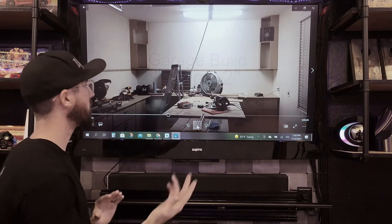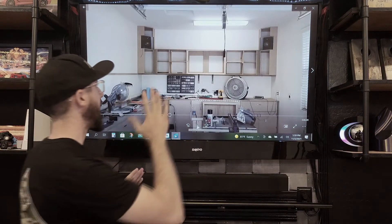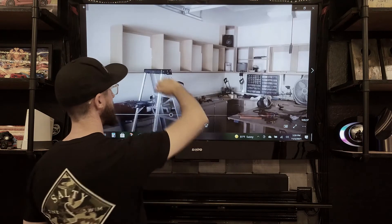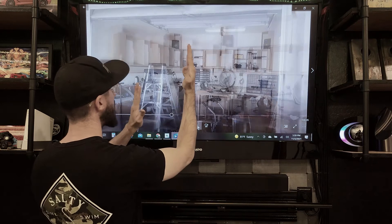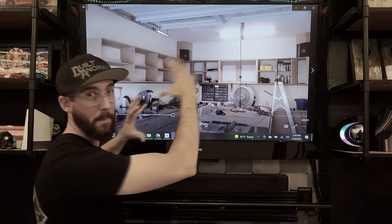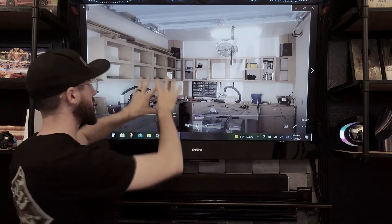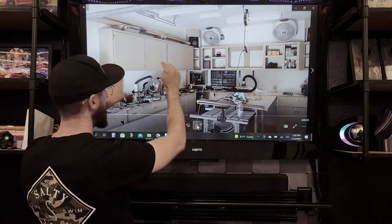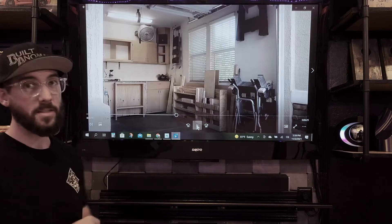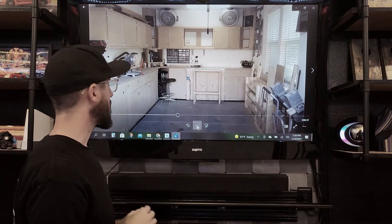Getting into the wall cabinet side — this is half-inch particle board. I would cut two-inch strips, attach the strip to the wall, the plywood lays in place, I tack it to that strip and build my box around it. Fast, effective, cheap, and strong. Once it's all nailed and glued together, I come back and screw it to the studs. I had several hundred pounds in these things with no issues. The doors were just straight half-inch particle board.